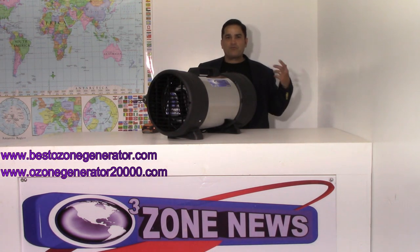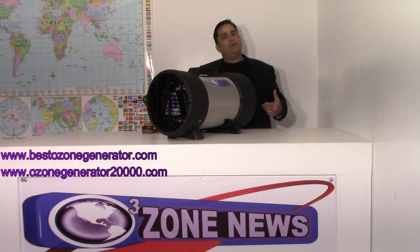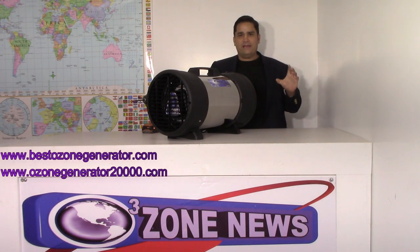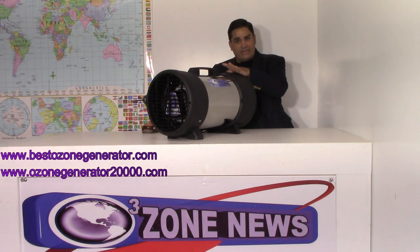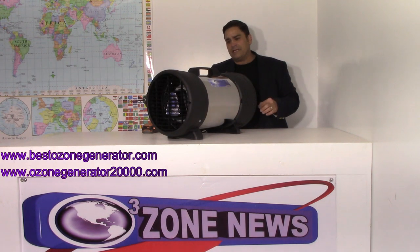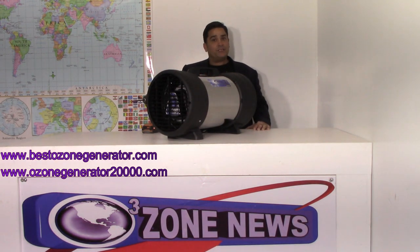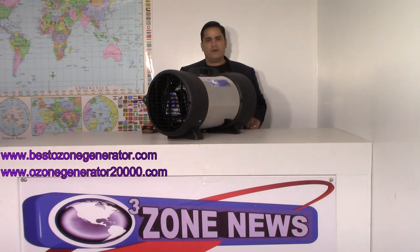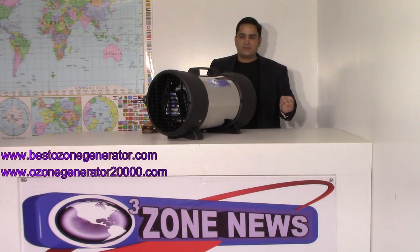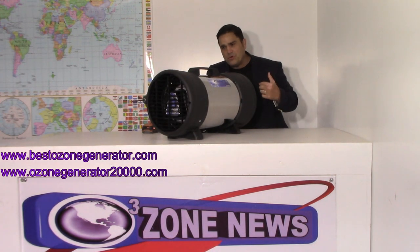In this unit you've got a breathable form of air purifier that will control odors, kill viruses, bacteria, and mold spores. The way a hydroxyl ion is generated is when the UV light frequency generated inside this machine strikes the catalyst, it creates millivolts of electricity. As air moves through the machine, the moisture in the air — H2O — that charge knocks an H off the H2O, generating hydrogen ions and hydroxyl radicals. That hydroxyl group is instantaneous and will instantly react with pathogens in the airstream moving through the tube.